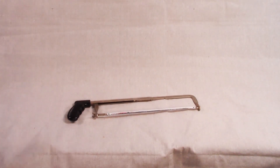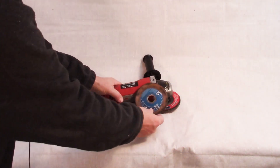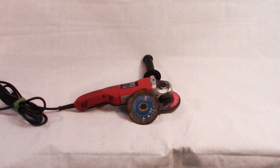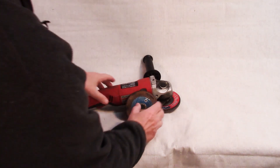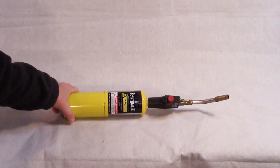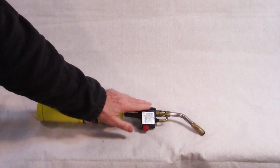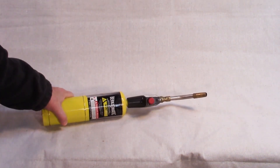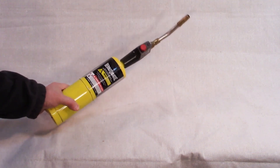Let's talk about tools. You don't need a whole lot of tools to do this. You're going to have to cut steel — a hacksaw is one way, but it's slow and pretty tiring. What I use is an angle grinder with a cutting wheel on it — I'd certainly recommend getting one of these. After you get your steel cut, you're going to have to heat it. It doesn't require welding. One way is with a MapPro tank and nozzle, which works but is slow — I used this for probably half the tool rests I've made.